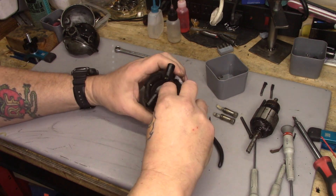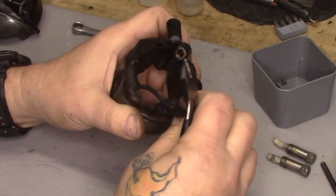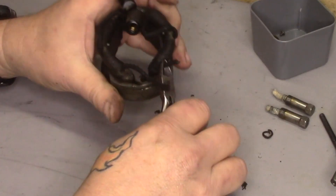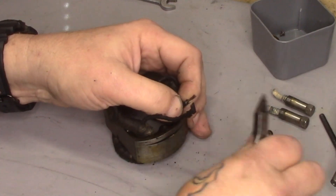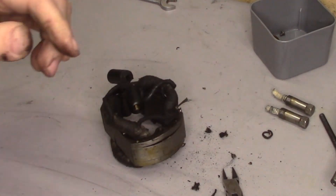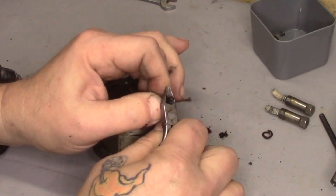Let's get back to our problem at hand. I'm going to cut this little binding string that's holding these two leads together, very carefully, and separate them out. I didn't leave myself a whole lot of room here. I'm going to very carefully slice through and strip this back. With these cloth insulated wires, you've got to be really careful — sometimes you just have to take it in smaller little bites.